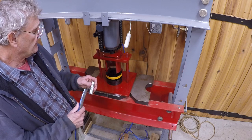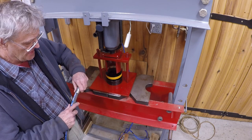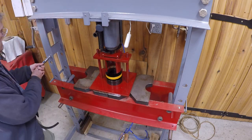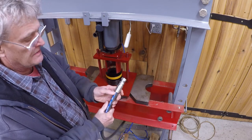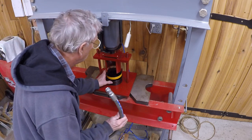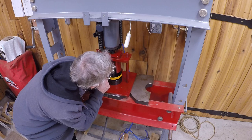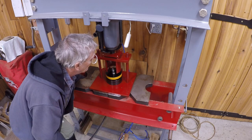This is the Eaton Weatherhead T400 — this is what this runs in. The way these work: you want to put your fitting on and first mark your depth. When you put this on, you make sure it's getting all the way up there. They're not easy to get in, and they're even harder to get out. The bottom of the fitting went to my mark. Then take your fitting, it comes up from the bottom, and you basically position it to the dotted line, which goes basically to the top of the collet. Then you just start crimping.